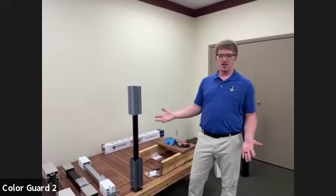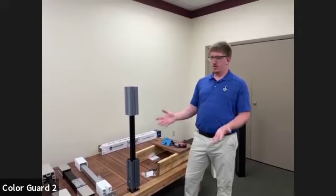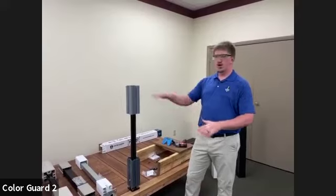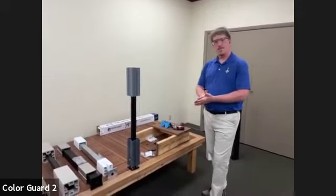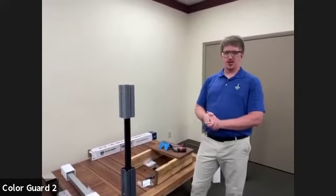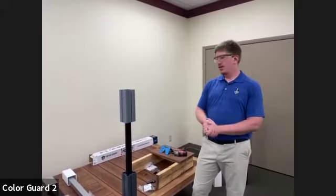There are so many different uses and locations where you can mount these. Even if you have some wood supports, you don't have to run your posts all the way through the deck — you can mount this in the corners instead. You can use these all across your deck. And another key feature: leveling goes to 11 degrees of adjustment in any direction. So even if your porch or deck or concrete is pitched for drainage, or you're using a handicap ramp, this is perfect for that installation as well.